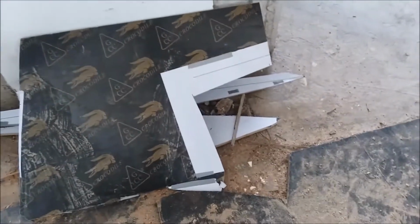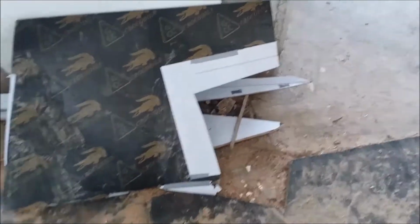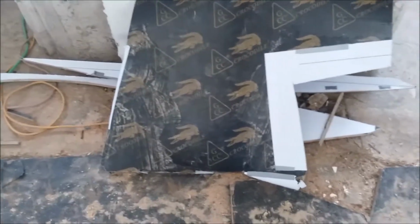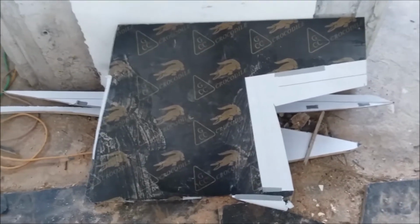Anyway, the way this was done is they took a sheet of phenolic board, just like this one up here at the top of the work table, just a new sheet. They rolled the pattern out on it. Now one end, because we couldn't print 48 inches, we made a supplemental piece, and that was off the end here. So this piece you're looking at is one of the tails that was left when we took the supplemental piece here and cut it off the pattern and used duct tape and stuck it on the 3 pieces that were actually on the print.